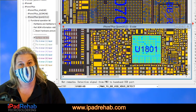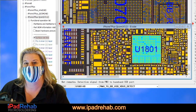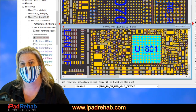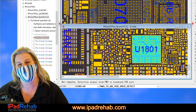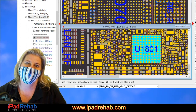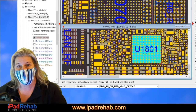And then I think that, without having any strategy, we just try to find that. Next we're going to have to go to voltage testing. Voltage testing is a really nitpicky, really laborious thing where we're going to have to start measuring around to see if we can find an inappropriate voltage. Because it may be that there's not a short to ground, but that we have something bridged to something else, which will show up as an inappropriate voltage on a line. So we're going to have to do a whole lot of measuring and figure it out.